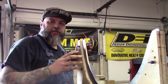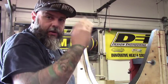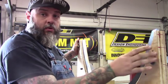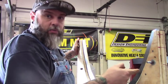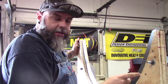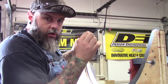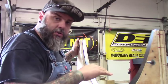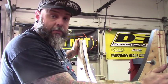I took three pieces of plywood, clamped them together, and cut it all out. On the top layer I did a 45-degree bevel. The reason is so when I'm swinging the hammer I can actually hit close to the edge — if it was straight up and down you couldn't get the hammer in there. Then we took the router and gave the second piece a very small rollover so it'll shape the metal and it won't be real sharp.